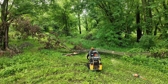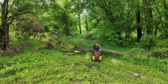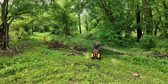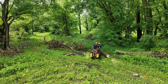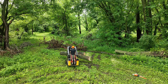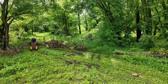What that does for me is makes it a little less risky. One of the major risks when you're running a chainsaw is potential energy — you have a lot of energy stored in the wood and you're standing right next to it. As things move and shift when they fall after you cut, that's where there's the highest likelihood of getting hurt. So by cutting 95% of the way through, I can just go up and grab it with the grapple and snap it off the rest of the way.